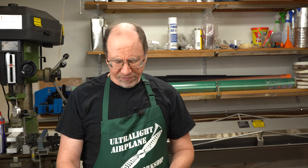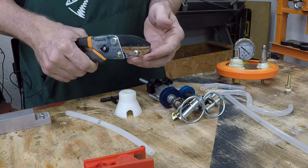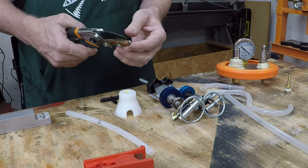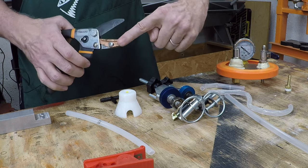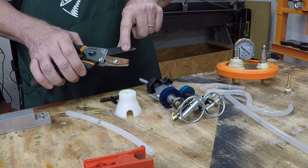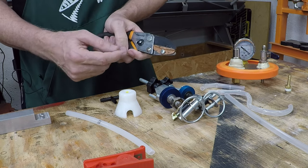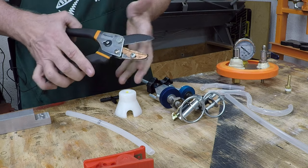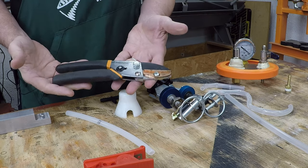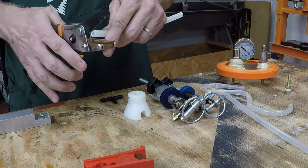What I prefer is this tool here, and it goes by a number of names — utility cutter, handy cutter, trim shear. There are quite a few names for this type of device. I've had this one for years. It has two features I like: an adjustable anvil, so if you re-sharpen the cutter and it isn't at the same angle, you can loosen this bolt, clamp it down flat against the anvil, and re-tighten it. It also has a locking mechanism so it holds closed and doesn't take up as much room in your tool drawer.